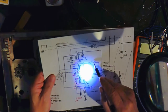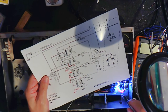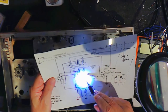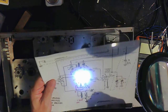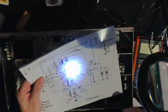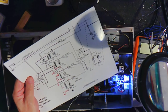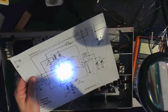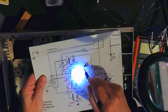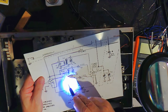Okay. A goes to the 3300 picofarad, B goes to C, no, B goes to D and then back to L9. B and A. Okay. This is also wrong. That's why. Okay. Rev 6. If I only would point to the right coil when I'm pointing to the schematic, no problems. A goes to the 3300 picofarad. B goes to D. B goes to D as well.